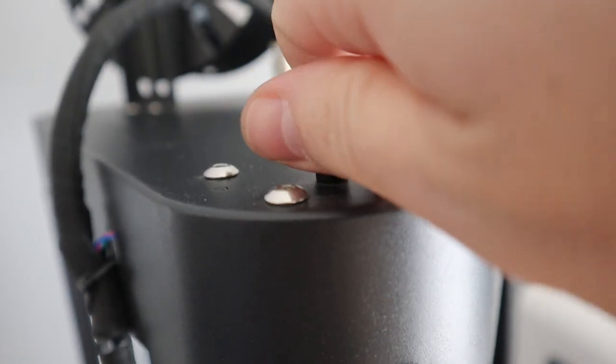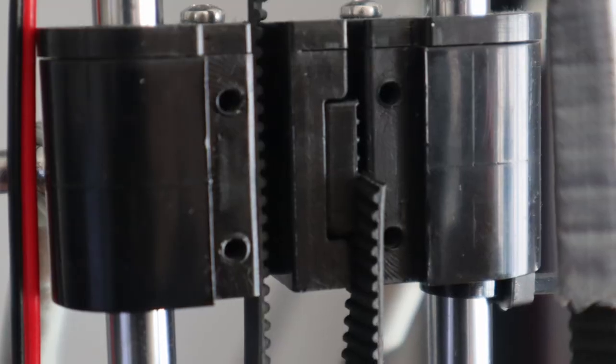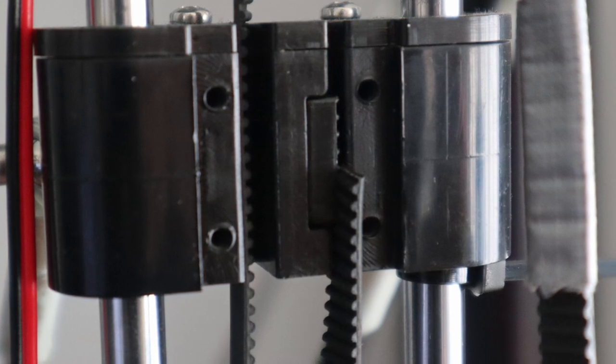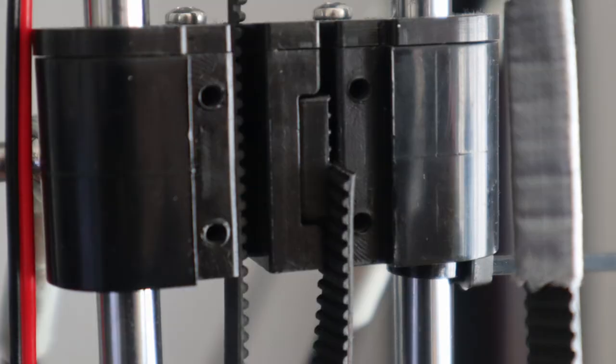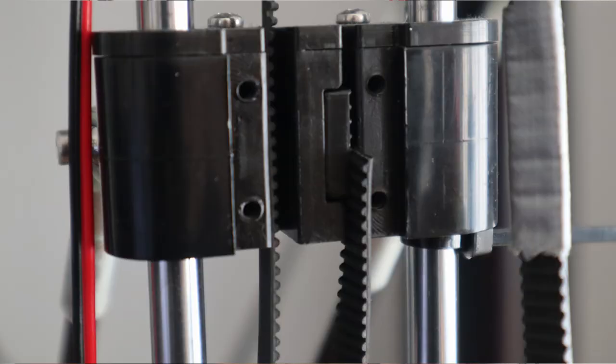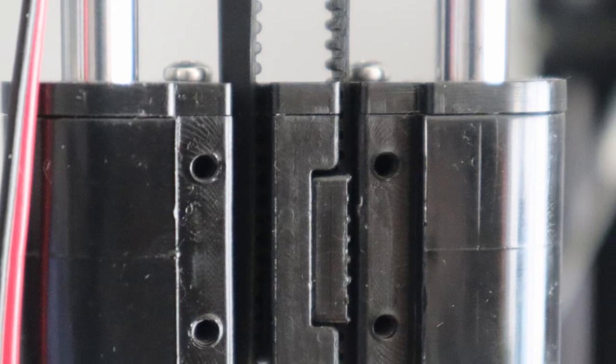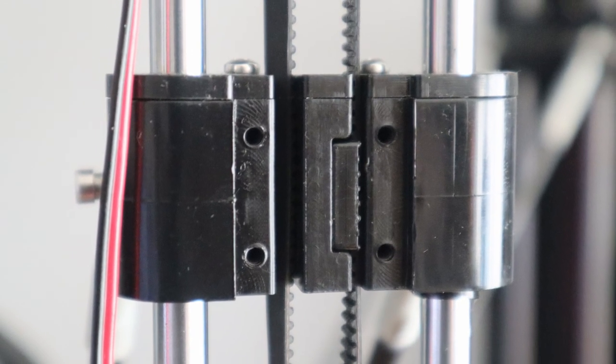Now comes the part where you measure your timing belt — make it as loose as possible first, then you can always tension it later. Make sure there is a little bit of tension on it, then put the bottom end in first, making sure it is cut straight with no angle. Push the timing belt into the grooves of the carriage without using too much force. Use a flathead screwdriver to make a little space, then push the timing belt all the way through to the end. You can also leave it slightly visible so you can see where the belt is. For the top, do exactly the same, and because the first one is visible, you can place the second one directly above it. Push everything all the way through.